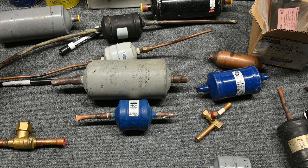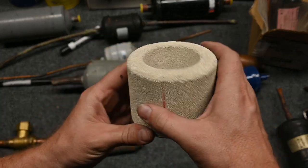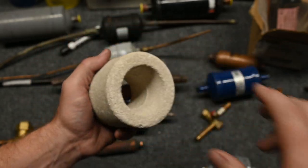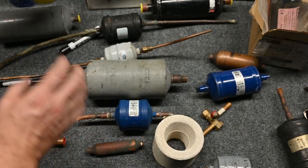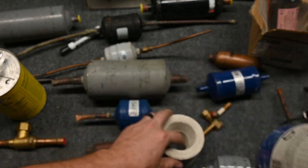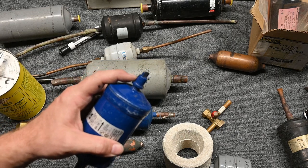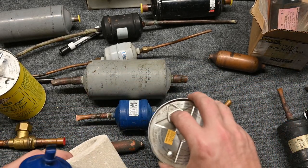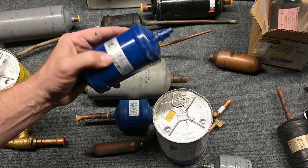Let's talk quickly about commercial filter dryers. The desiccant looks like this — if you drop it and it cracks, you're going to have issues. There was a picture on Facebook where this had turned to sand; I can't imagine other than vibration what would cause that, but it's a bad day. This one's been cut so people can see it, but they still filter from the outside to the inside. When you order those, they come in sealed cans. As soon as you pop this top, the desiccant material starts absorbing moisture — same thing with these filter dryers. As soon as you pull the ends off, they're pulling out moisture from the air. So make sure when you're ready to work, you pull that cap at the very last minute and work as quickly as possible. Flow nitrogen through so you're using that capacity to absorb moisture from the refrigerant.